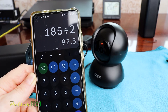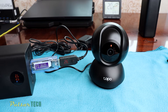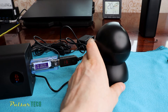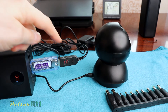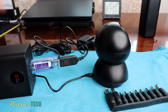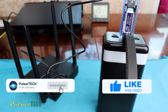So there you have it — you can run almost anything from this power bank: a security camera, a docking station, a router. It's actually a better choice than purchasing an AGM or gel battery if you don't need to run high power devices like a fridge. For small devices up to 12 volt and 20 watt, all you need is the power bank, the USB quick charge trigger, and a set of adapters. I hope you find this video helpful — give it a thumbs up and subscribe for more.